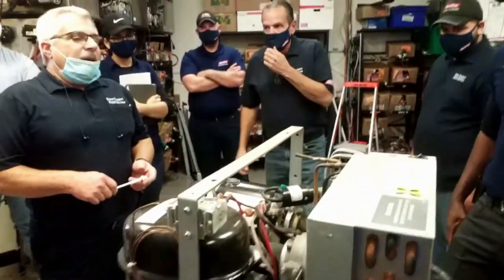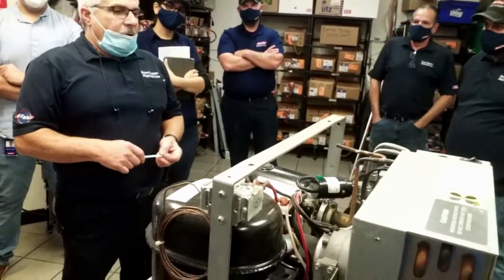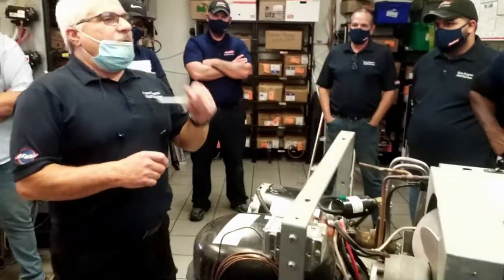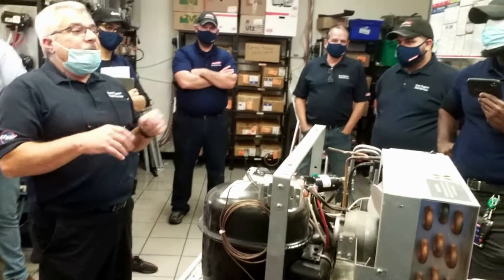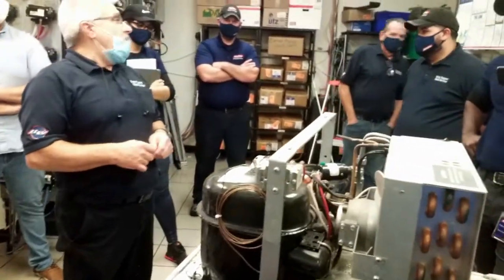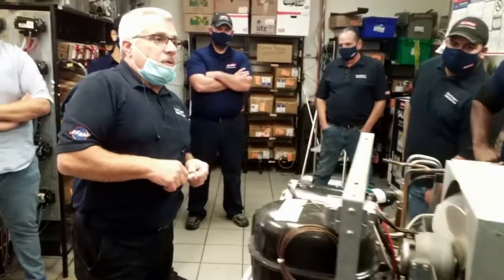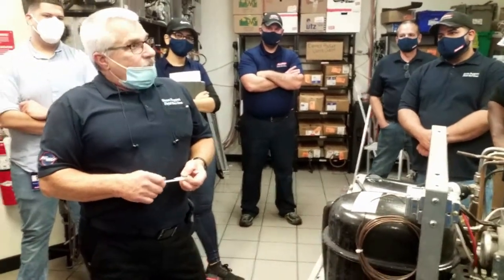The other thing that can happen is when you go to get a drink and it's just air, that ice bank in there will freeze solid. It'll just keep freezing until you look in there and it's nothing but white. It's frozen solid. That control has stopped closed. At that point, you're going to have to unplug it.